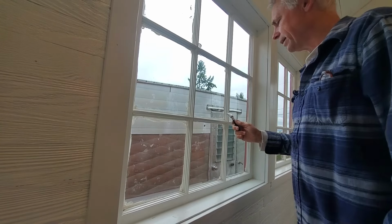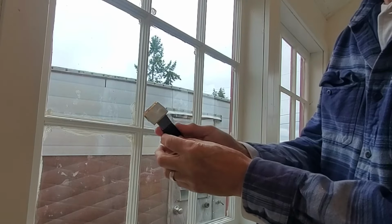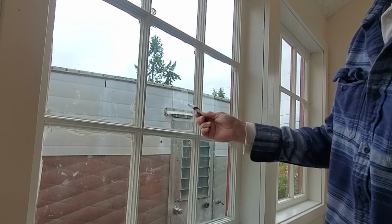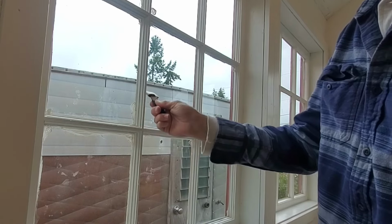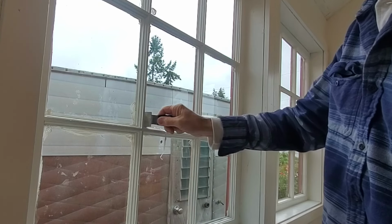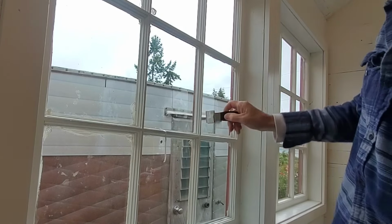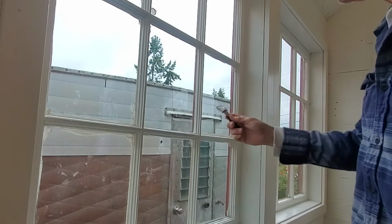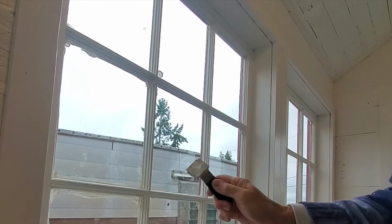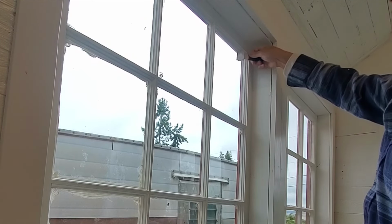So I just painted this last night, so the paint's fairly green. It's pretty easy to just take your razor, and this is what I'm using. The tape here is so when I rub up against here, it's not damaging the wood any. About that fast you can do a window. Clean out the little bits and move on to another pane. I'm angling it just a little bit inward, but it depends on how your window sashes are. This is kind of what works out best for me.